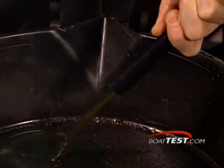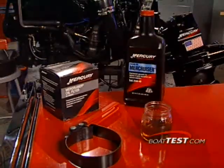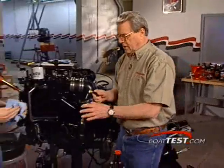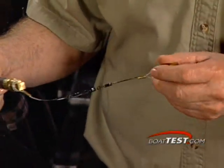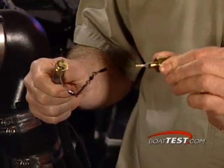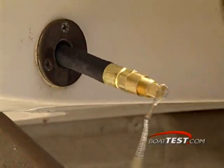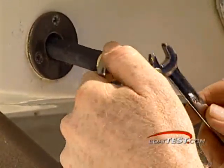Is this the only means of draining the oil, Don? No, there's another way of doing it. Let me show you by stepping around to the rear. We have the quick oil drain system on later model engines. This hose is connected right to the drain plug or drain hole in the oil pan. This plug is connected to your bilge water drain plug in the back of the boat — it has a tether between this line and this plug. Once you take the plug out of the boat, remove this plug and let the oil drain out.